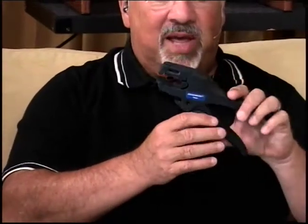Yeah, the one I have in the hand with the more or less flat blades is to strip just standard wire. I don't know if you can see that here, but you have your depth of strip adjustable. You also have a tension adjustment, so you can set how much. But operation-wise, you push the wire into the adjustable stop.